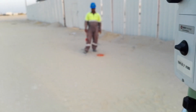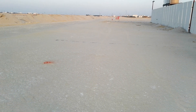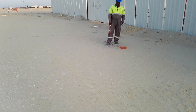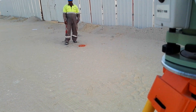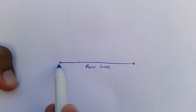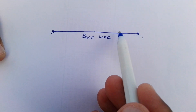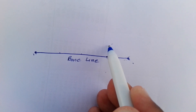Here is my first point and here is my second point. I will observe these points on site, or alternatively I can give coordinates if I have them from my drawings — but here I will only observe the points. As you can see, I have a straight line. This is my first point and this is the second point. I observe both points to get the total length between them. Then I will make one more point in between — 1 meter from the first point — and then make one offset.